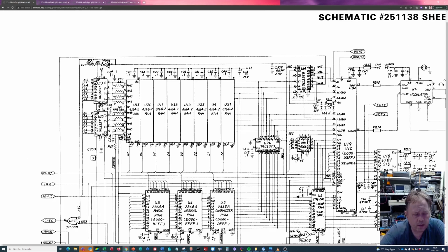It did not stand in a socket, and the soldering and the work that was done there looked really, really bad. And we probably remember from the beginning of the video when I did the scope pictures, I traced a fault to A1, A2 and A6, and they're spread over two of these chips, and this chip was actually changed. So I do think that this chip is actually working, so I have no good explanation why this chip should draw something off the bus or make a short on the bus.